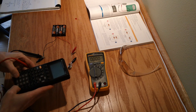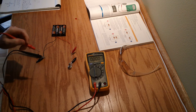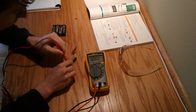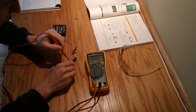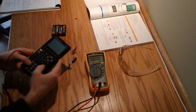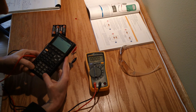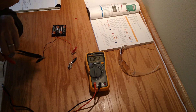It's 6.4 volts and 3,000 ohms — yes, that gives 2.133 milliamps. If we put the probe here and gradually turn the resistance down on the potentiometer all the way to the right, we're increasing the current flow up to around 7 milliamps. Essentially, the potentiometer is no longer offering any resistance, so we have 6.4 volts divided by just 1,000 ohms, which is about 6.4 milliamps — right about what we saw, somewhere between 6 and 7. So that makes sense.